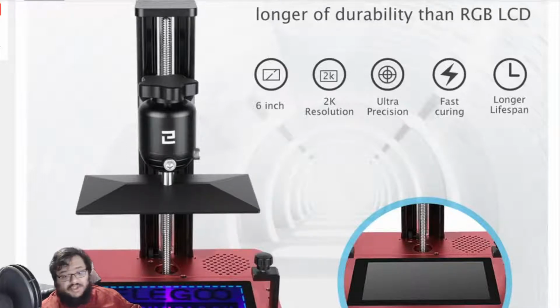Now, I have a bunch of silicone, and it's all Shore 20A. Shore is a rating of the stiffness, the firmness, of a flexible material like silicone, and Shore 20 is pretty low. If you ever looked at a material such as Ninjaflex, why don't we just pull some up for reference, because Ninjaflex is Shore 85. We're just going to let this load up real quick, and then I'll bring it into view.